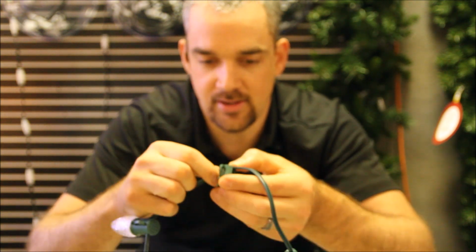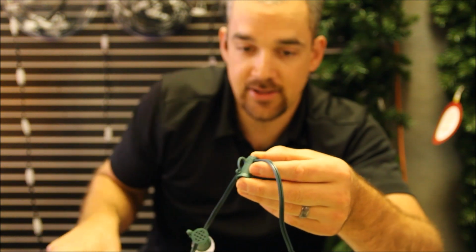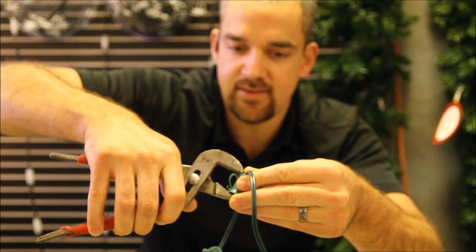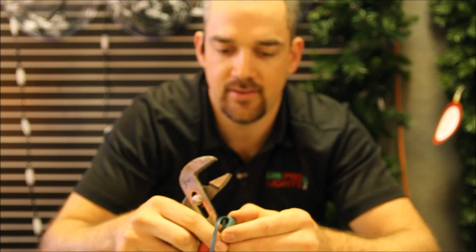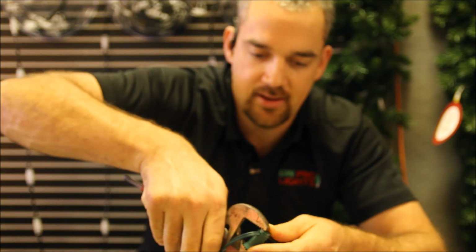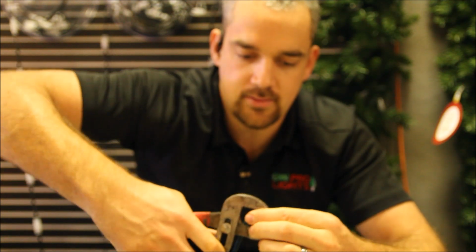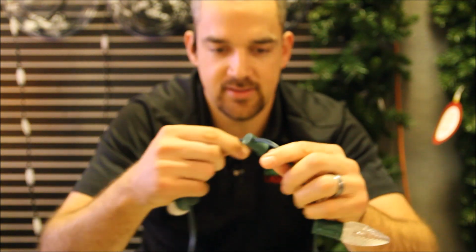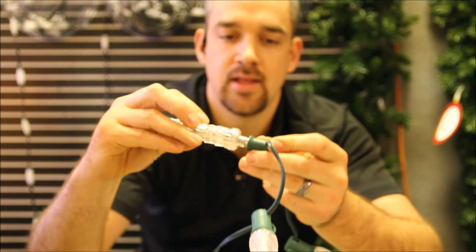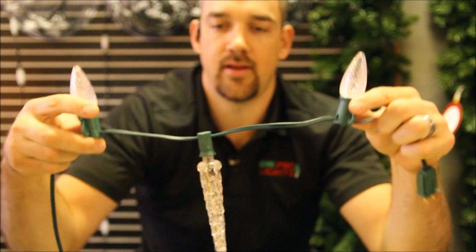So I'm just going to place this here, and I've got my backer, and I can take my channel locks and just slide that right on. Alright, there's that there. And then on the other side, I'll just clamp that right on. Alright, so that socket is installed. Now I can take my icicle light and screw that right in. So it'll look something like that.